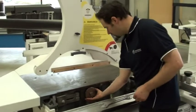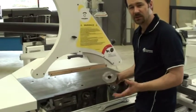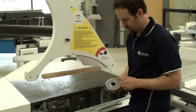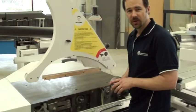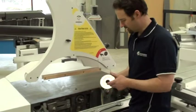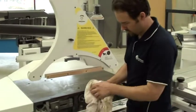The reason I wanted to show you how to do this procedure is we've had many calls over the years from clients who've actually done a simple blade change and they've left some dust or contaminants on the flanges themselves, which can actually throw out the saw blade. And then we've received a phone call saying my saw is not cutting correctly. It's sometimes as simple as contaminants on the flanges.